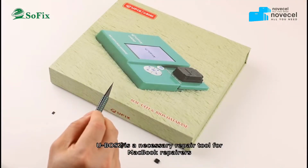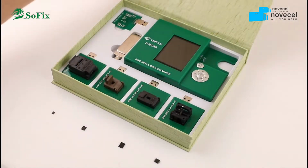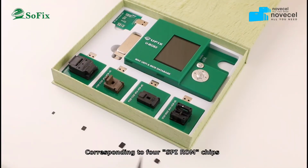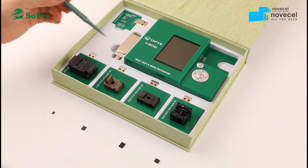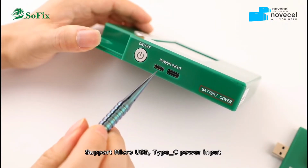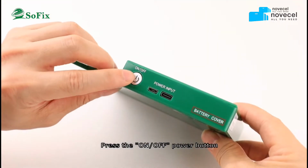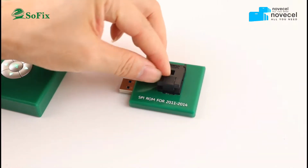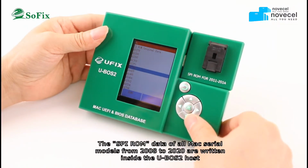About Macs from 2013 to 2017, UEFI Macs, and the T2 model: before we were talking about the T2 model, also the same. For the T2 model, if you replace the CPU or replace the PCH, you also need to write the T2 ROM data, or go into DFU mode to restore T2 firmware. Remember, if you only replace the CPU or the PCH, the display is also very slow, the image is very slow. You must write the T2 ROM or go into DFU mode to restore. When the restore succeeds, it can display very fast.